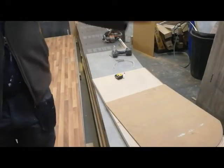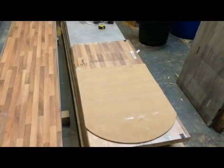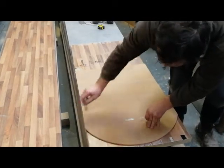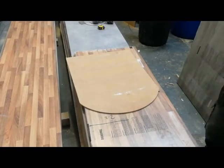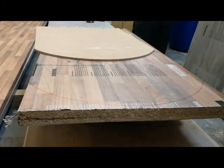I'm going to set the router up and cut the waste off the worktop. I've cut the template out and placed it on the worktop, and now I'm just going to go around it with my marker pen. So that's going to be the template for my curve. Now what I'm going to do is cut the excess off with the jigsaw, get rid of all the waste — makes it easier then to router it out later on.